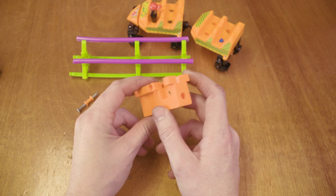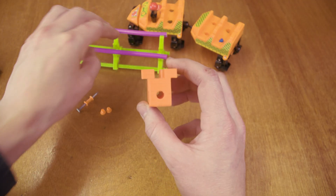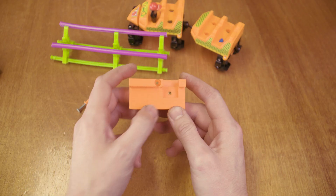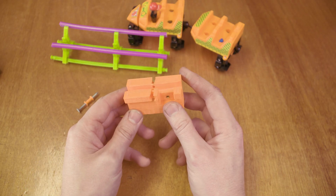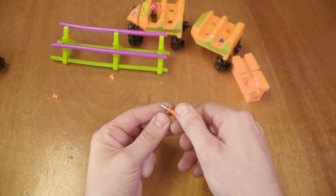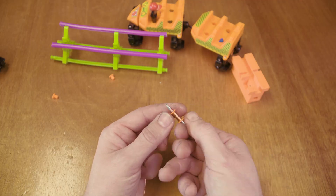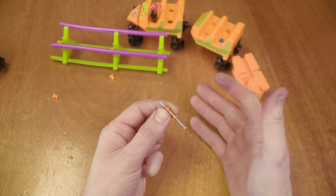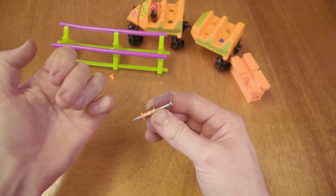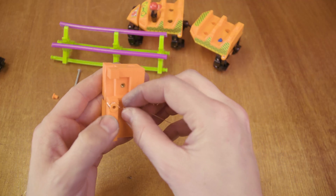And this is what I came up with for the motor itself. It fits safely within the track envelope. The train can pass over it, and it's got mounting points for our electromagnetic coils and a mounting point for our hall effect sensor, which will detect the train's position. This is going to take an eternity — I'll check in with you a bit later. We've done 5 layers: down, up, down, up, down. And then we pop that in. Let's make another one.